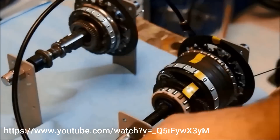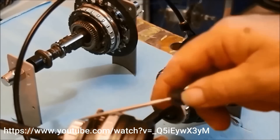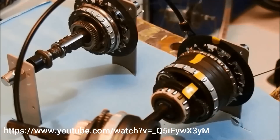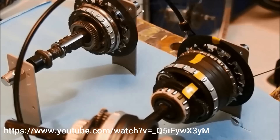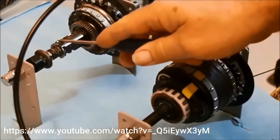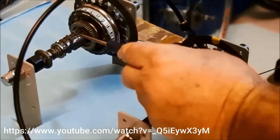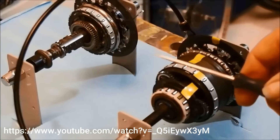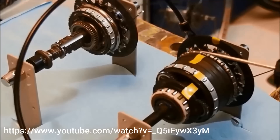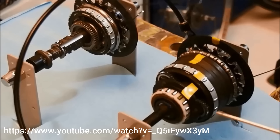These planetaries drive a ring gear on which is mounted a roller clutch which transmits power to the hub shell. The larger the sun gear in relation to the ring gear, the greater the differential in speed between the units. The sun gears are engaged by means of rising pawls which are actuated by the shifter through an actuation arm. In order for power to be transmitted to the ring gear, one of the sun gears must be coupled to the axle to become the fixed reactionary gear. Sun gears not coupled to the axle are free to rotate and will not function as a reactionary element.